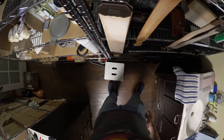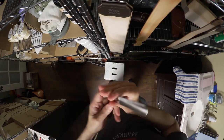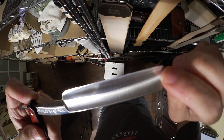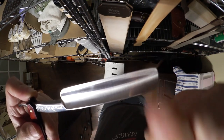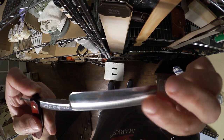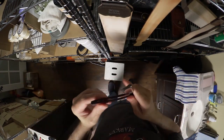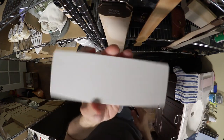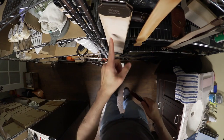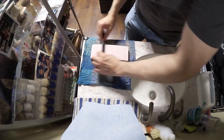So let's go hone on that for a while until I really start to take over the bevel with those marks. Those marks will start from the spine side of the bevel where you can see the scratches, and it will move gradually toward the edge. Hone on that until I overtake about 50% of what is there, and then switch to a hone with a long shape, and then finish on this Norton Ascent and strop. Hopefully it sounds thinner. And let's shave on camera. I haven't done that in a long time, right?